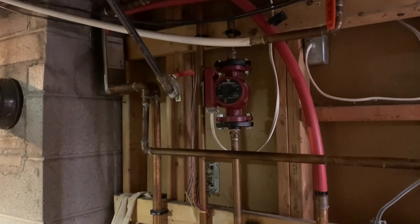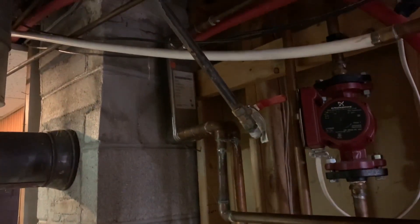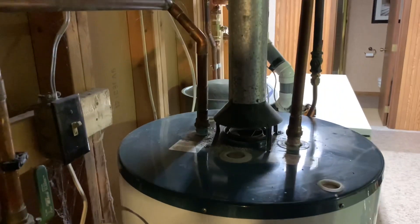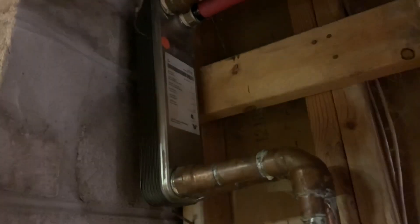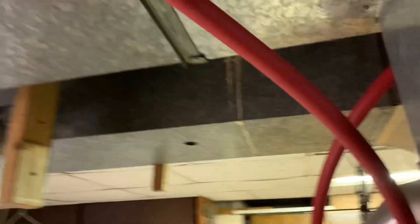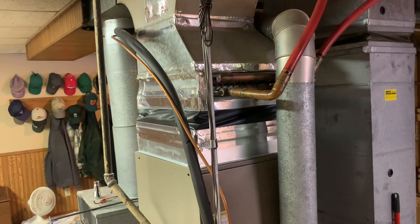Here's the waterworks in the house. You get your hot water line coming in from the boiler loop, comes down and runs through an additional pump, then goes up into a plate exchanger. What this plate exchanger does is it replaces the water heater in the wintertime — it's in series with the cold water that goes into the tank. You shut the gas off and it will run a continuous instant amount of hot water. On the output side of that plate exchanger, hot water continues through into a coil that drops into the plenum of the furnace, and then you can cycle your fan and run your air through there instead of burning gas. Then that returns back out to the loop into the other shed.